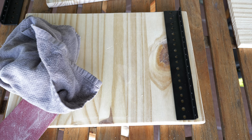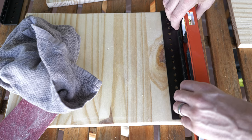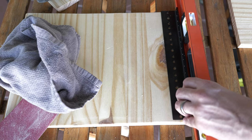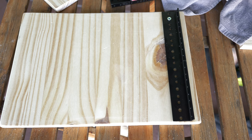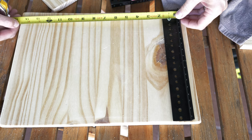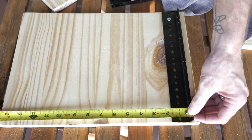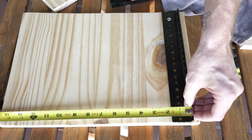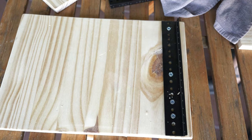Now we're going to secure the rack ears. I lined up that eighth inch gap on the top and the bottom by eye — I didn't actually measure it, but it feels pretty much equal on both sides. I picked about a half inch in from the edge so the rack gear can recess a little bit into the unit. I secured the lower part, then measured the top part to make sure there were equal distances from the length of the wood. Secured it, put in several screws, and then repeated the same thing on the other side.